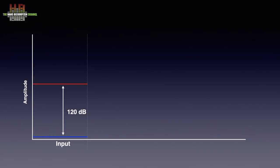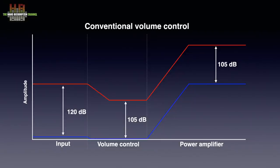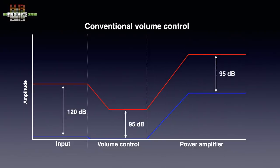An amplifier needs to be able to amplify those lower signals to normal playing levels, so it must have at least 16 dB more gain than needed for digital sources. Above that, you don't normally play music at full level, so a volume control is needed. If the level is reduced by, say, 18 dB, and an amplifier has only a few dB more signal-to-noise than the 120 dB a digital player offers, the signal-to-noise of the audio signal is reduced by the amplifier noise — let's say 105 dB remains. That signal is sent to the power amplifier to be amplified, resulting in the amplifier noise also being amplified. The signal to the speaker remains at 105 dB signal-to-noise at best, and if gain is further reduced, even less remains.